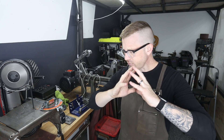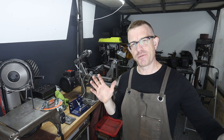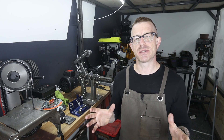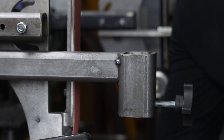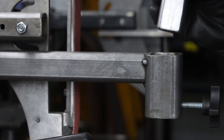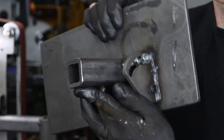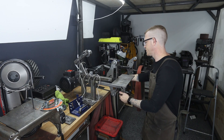I've already gone ahead and manufactured a really nice 24-inch by 6-inch work rest that sits in the receiver tube on this particular tooling arm. The way I designed the receiver hitch that holds the work rest is so that it can be hot-swappable. You can do all kinds of different things without creating a whole other tooling arm — you basically put a one-and-a-half inch by one-and-a-half inch piece of steel on the bottom of whatever work rest you want and it will accept it right here in this receiver tube.